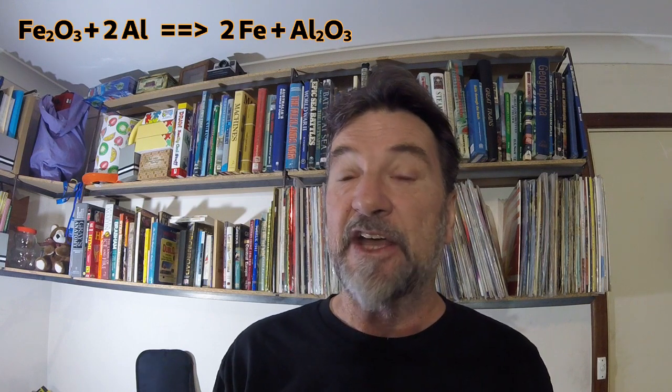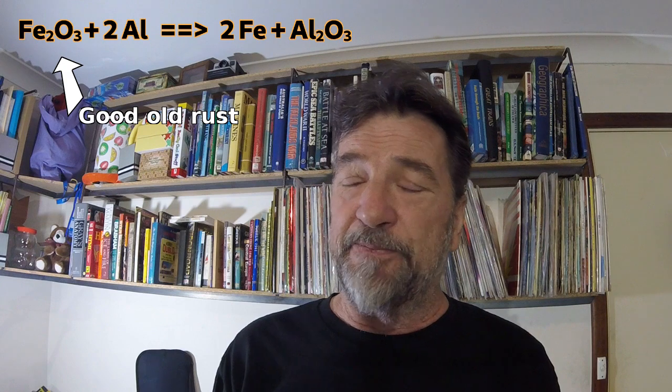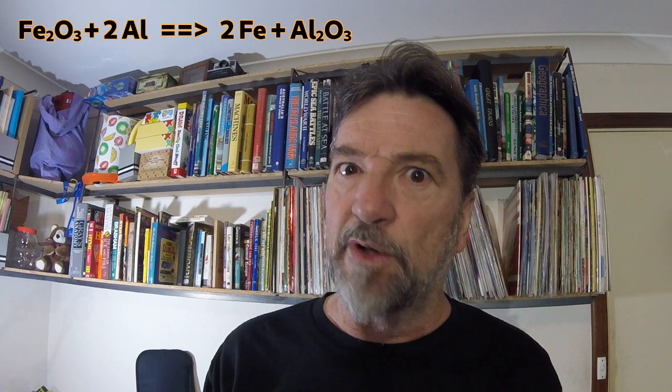And the way this works is aluminium. Aluminium is an extremely reactive metal. It burns really well. But if we're joining railway together, aluminium is our friend. Those of you that did chemistry in year 11 and 12, or whatever the equivalent is in your part of the world, will have come across something called a redox reaction. And if I think back, I think that's what this is. We start off with aluminium and an oxidizer. And in our case, the oxidizer is rust, iron oxide. If we get this hot enough for the aluminium to burn, it'll grab the oxygen out of the iron, which leaves the iron by itself as molten iron, which can flow into our weld joint. And we get aluminium oxide on top as a slag.